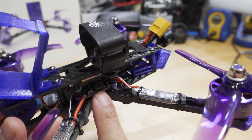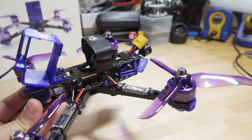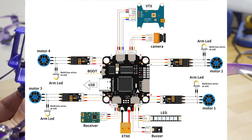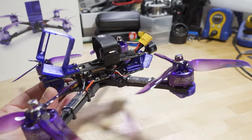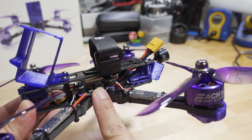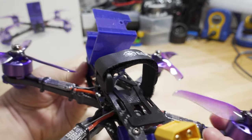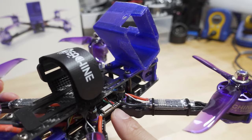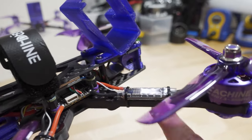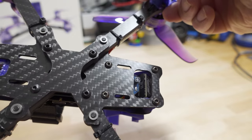Now we have a PDB flight controller combo — a single board with a USB-C port. There is a wiring diagram not on the product page itself, but if you go to the product page there's a link to a manual PDF that contains the wiring diagram for this flight controller — something you'll want to download and save in case this product gets discontinued. It's an F405 with about six UARTs, and it has a plug for DJI if you want to upgrade to digital later, though that's not included. I soldered my ExpressLRS receiver to the pads here — there are three UARTs available on those pads — with the antenna sticking out of a little space in the bottom for pretty good reception.